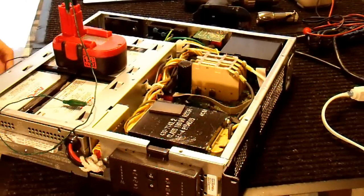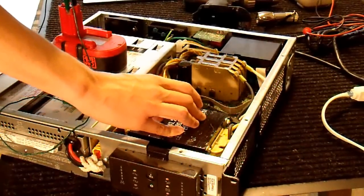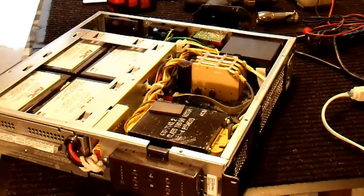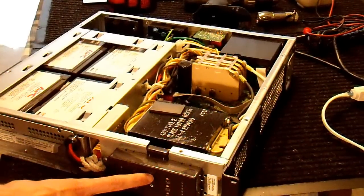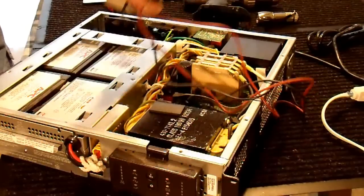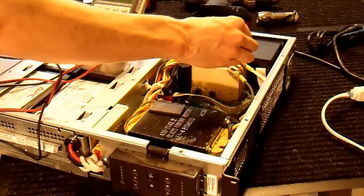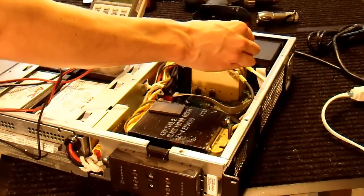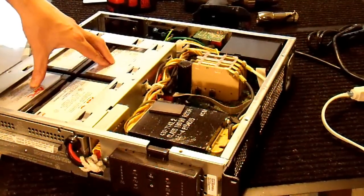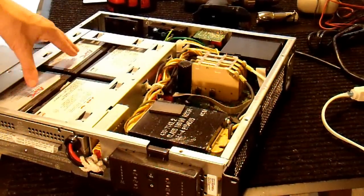And it clicked. I think it started up. I can hear the transformer buzzing. I'll hook these quick before I do something stupid. Let's see if it's charging first. Put my meter back up. Negative here, positive here. And I'm getting 27.8 volts. So it is definitely charging the battery. A battery that's been that low on voltage is most certainly destroyed, so this battery is bad — it will never be useful again. But that's fine, I already bought some other batteries for it. I never intended to use these with this unit.